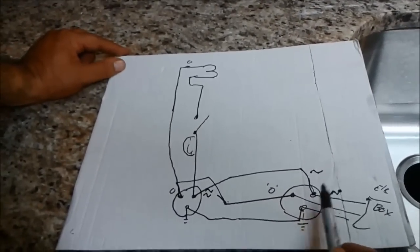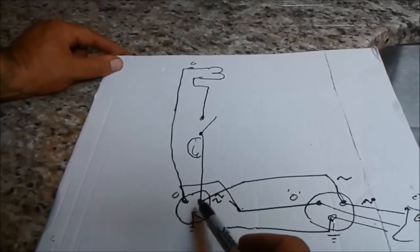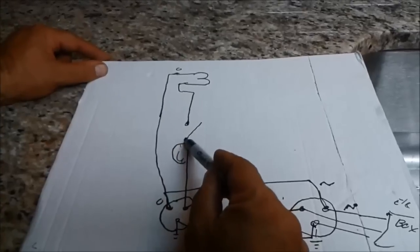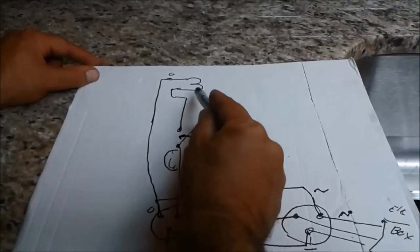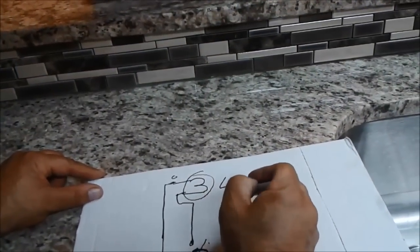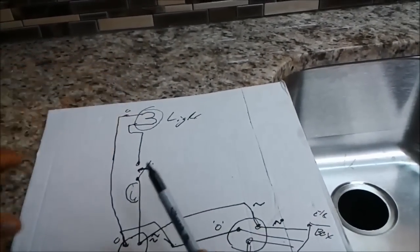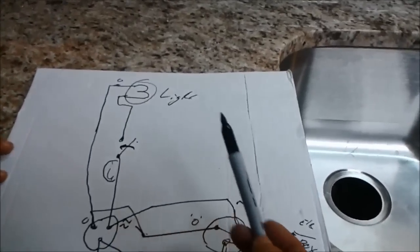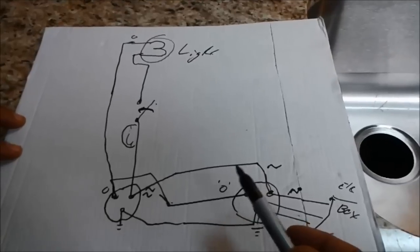I am going to take from the outlet that already exists and is connected to the box, to the other outlet. From this outlet I am going to take the hot and connect it to a switch. When the switch is closed there is going to be current going through and the light will turn on. You will also have your outlet as a source. By the way, today the light is usually LED and takes maybe 10 watts maximum, so there is no problem with the code.